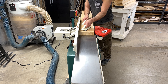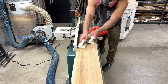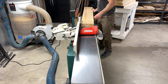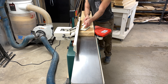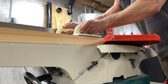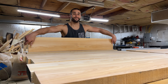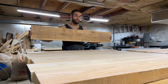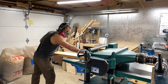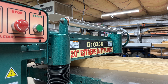As you can see, the concave side faces down, giving you at least two points of contact on the jointer surface rather than a convex side where the board would wobble left and right. Now that that face is flat, we reference it on our planer and get the other side parallel to it. At this step we're not taking the boards to final depth — we're only cleaning them up so we can take them inside for the next step.